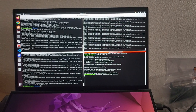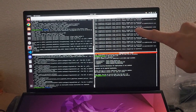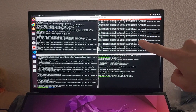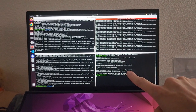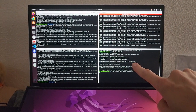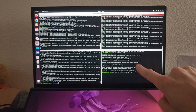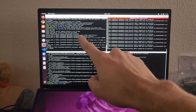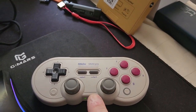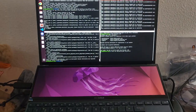I'm gonna give a quick rundown of my system. I have three ROS nodes running right now: a tank control node which handles the tracks and moving the tank around, an LED control node handling a little servo moving back and forth and RGB control on the little searchlight thing, and my controller hooked up via Bluetooth to the Raspberry Pi that's actually on the tank.